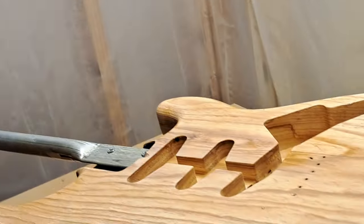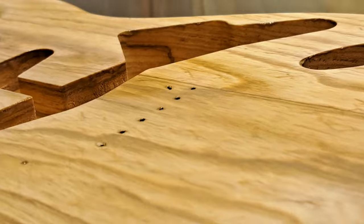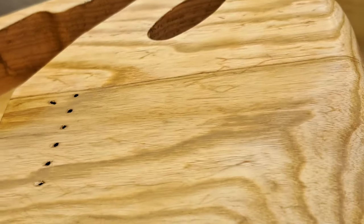But what I don't want is a deep divot grain somewhere right from the beginning, let alone later — where you can tip the guitar on the light and see the whole pattern of the grain slightly sunk. Swamp Ash is going to do that no matter what you do, unless you use some kind of epoxy resin sealer and sand it with a machine. And you can do that, but now you don't have a lacquer finish — you might as well just finish the guitar in poly. Because putting nitrocellulose lacquer over something like that is, to me, a waste of time. It's a buzzword factories use — 'thin skin nitrocellulose lacquer' — but over what? Over an epoxy resin? So you might as well just finish the guitar in poly and do a really nice poly paint job.